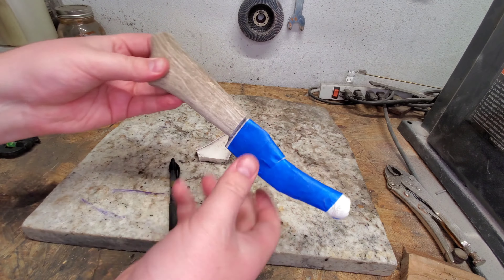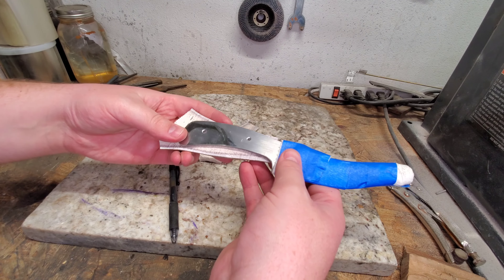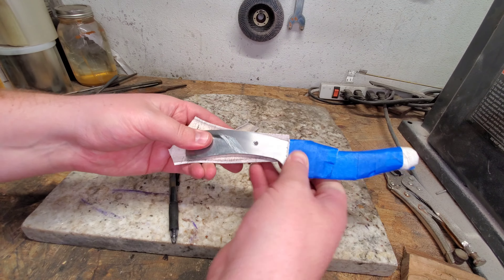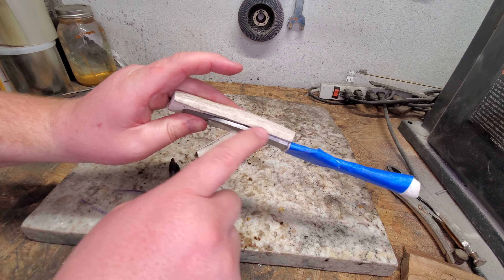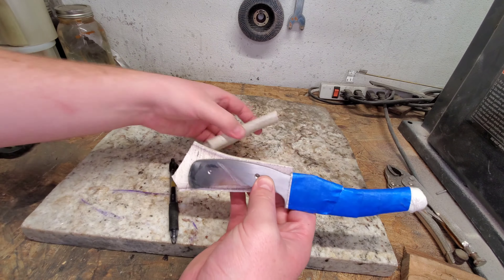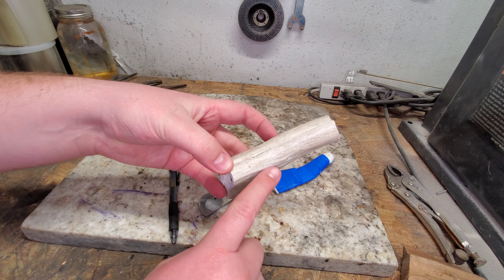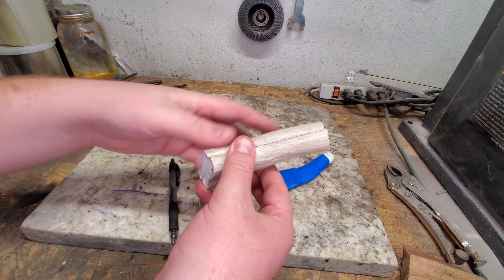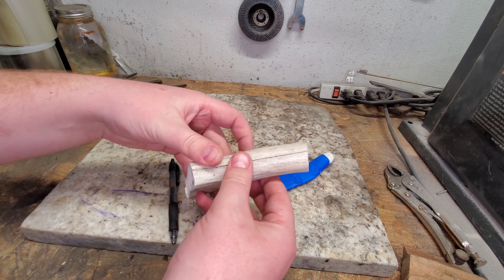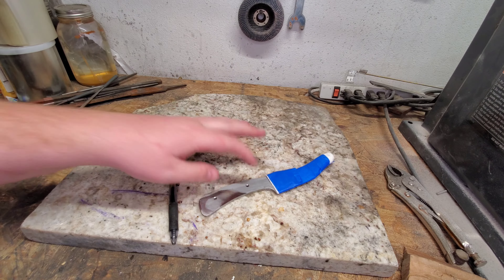I like it that way better. Now when we look at it, we can line them up exactly how we want. It wasn't a perfectly flat cut, so now we go and sand it flat, get it level, and try to keep them as even as possible — this one divots in and this one has a little bow. We may need to take off a little bit in the front, but first we're gonna make it flat so we can punch and drill our holes.